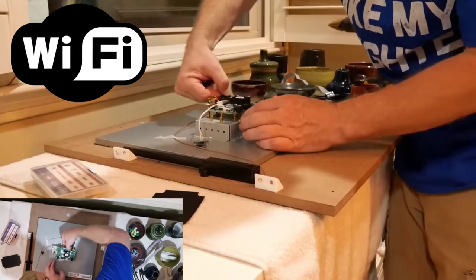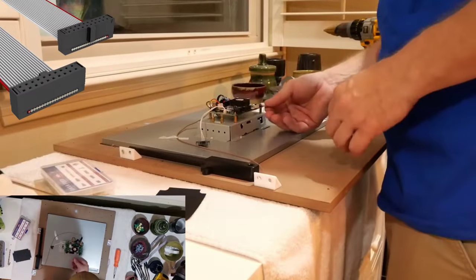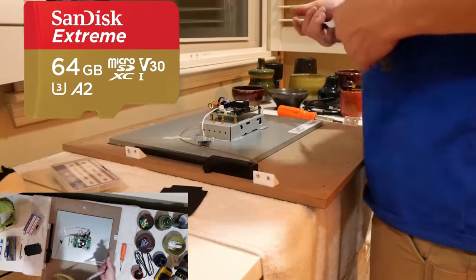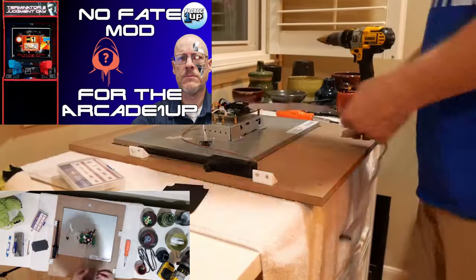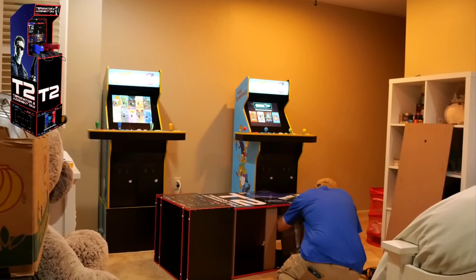The Wi-Fi will connect at the top and be on the right side of the 2 monitor cables. We, of course, can't forget about the ribbon cable at the bottom, and if you've done the no fake mod by misdirection, then be sure to insert your SD card. If you'd like to learn more about the no fake mod, I'll be sure to link to it above and in the description. We'll now need to reinstall our modified PCB board and monitor back into the T2 cab.